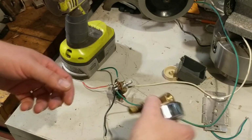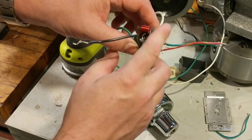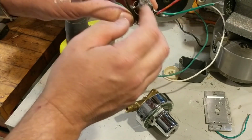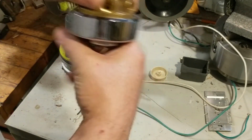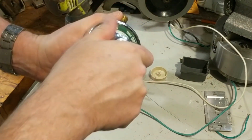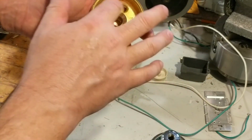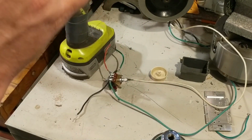All right, today is tomorrow, and so yesterday I finished up. I potted the bottom surface of this. This connection here is 120 volts. I potted this with JB Weld, which is an insulator. I'm going to be setting it in here using the JB putty, JB steel stick, I guess it's called. I haven't been able to determine if that's truly an insulator or not, but I know that JB Weld is. So having covered everything that's electrically live, that's going to be in contact with the base, with JB Weld, and then adding a layer of JB steel stick, I feel good about it.